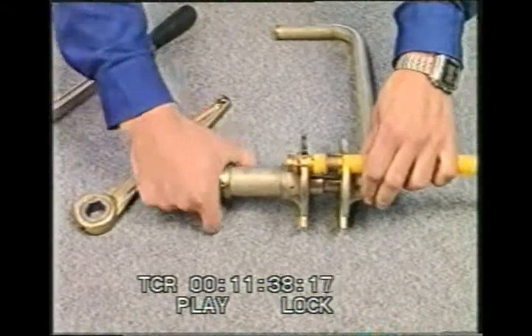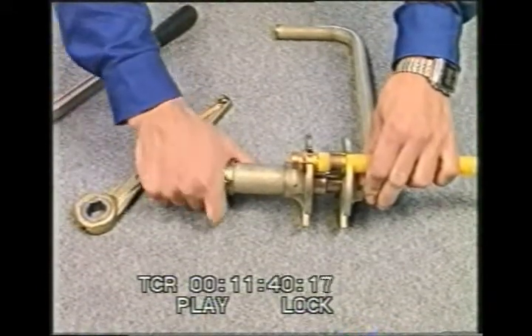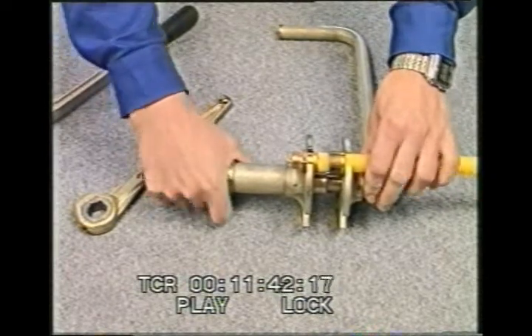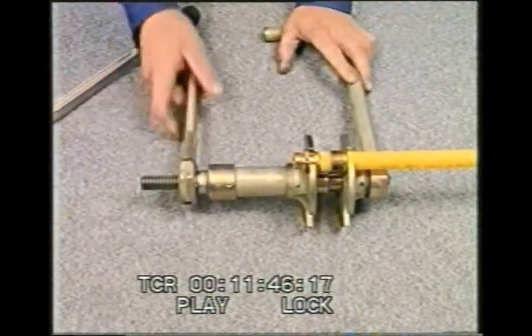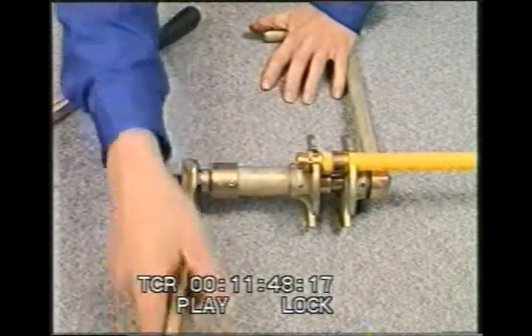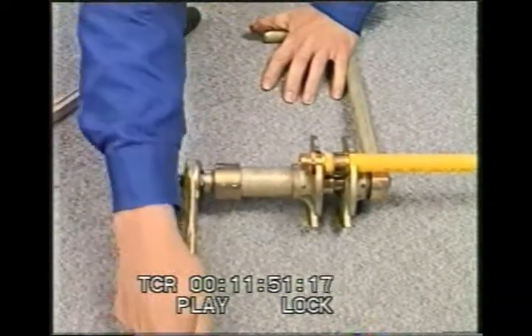Then the ring is slipped over the expanded throat. In this way, the prepared joint is 100% tight and is immediately ready for pressurised load. This method of cold connecting needs no other energy input.